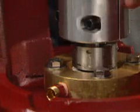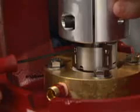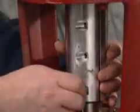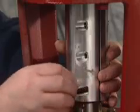Using your Allen wrench, loosen the seal collar set screws. Once these are loosened, the seal collar should spring up slightly. Using the three-eighth inch Allen wrench, undo and completely remove the six socket head coupling bolts from the split coupling. Each of these bolts will also have a washer, so be sure you keep them together.